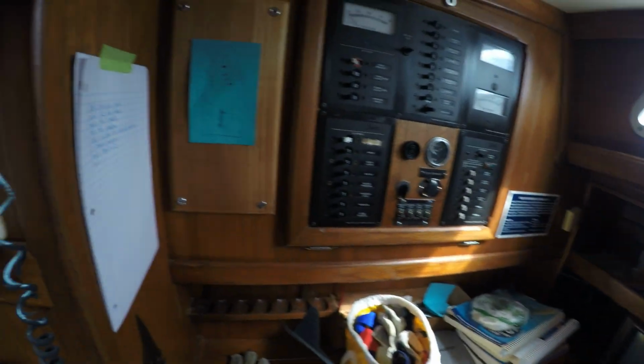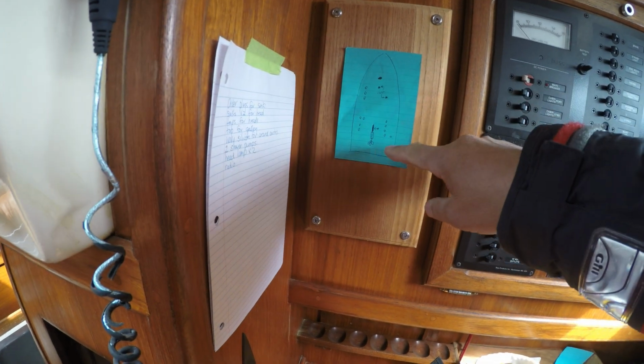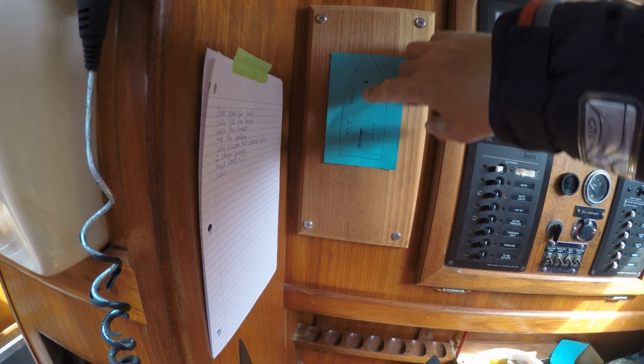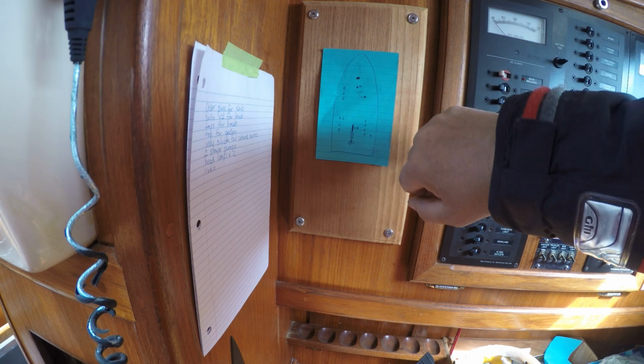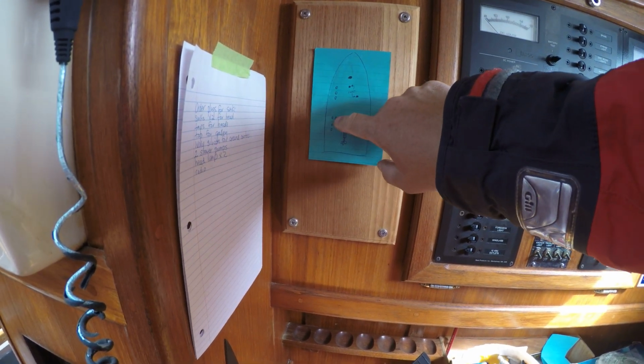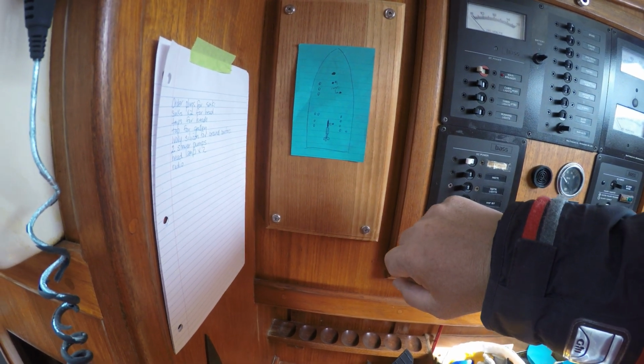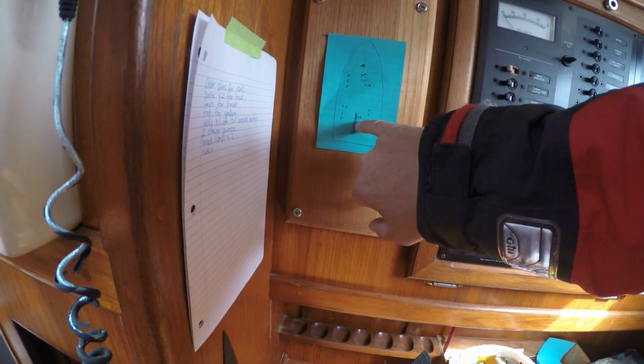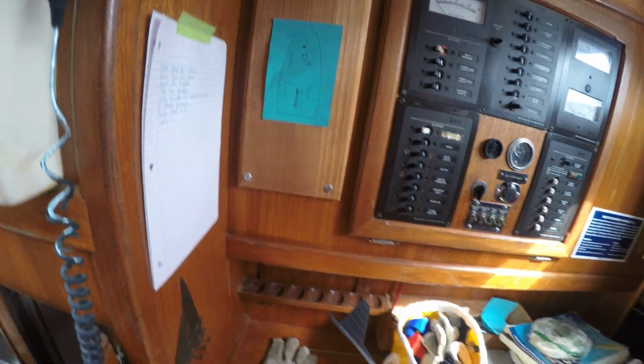We did a little chart up, and this chart shows all the penetrations in the hull. So there's the little one up forward that we just got working. This one is not. These two are working now. And we're going to go to the back of the boat now. We're going to look at these 4 on the port side again. These 2 represent instruments. One of them I've repaired already and reinstalled. And this is the stuffing box, which we repaired before we left Rock Hall. So 15, actually 16 hull penetrations. I was wrong again in total. 13 of which are opening through hulls. And of those 13, I believe we have 5 working.